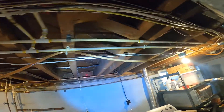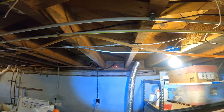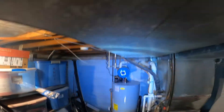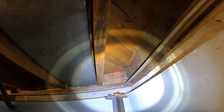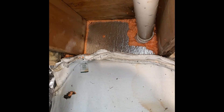Here you can see all the different penetrations — there's a plumbing penetration, likely the outside hose bib, wires, and the dryer vent going through the rim joist. This is just a great area to seal. What we do is use spray foam: we spray foam the area around the penetrations, insulate, and you can see how the penetration comes to the outside and how it all works together.